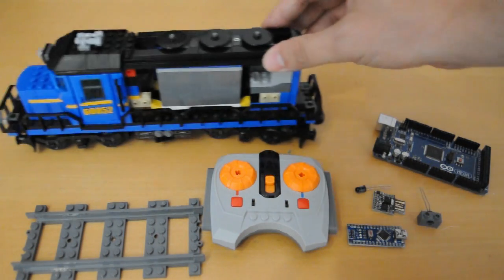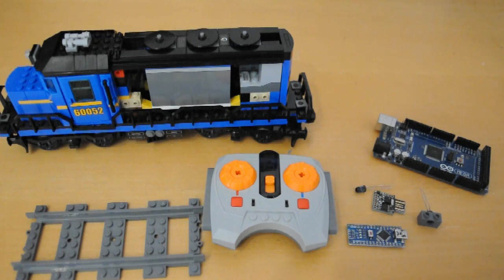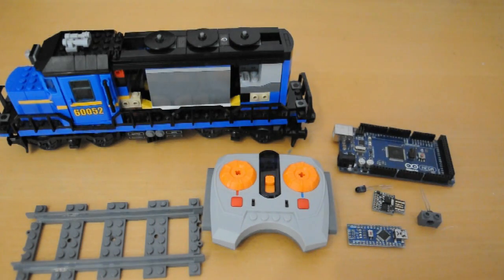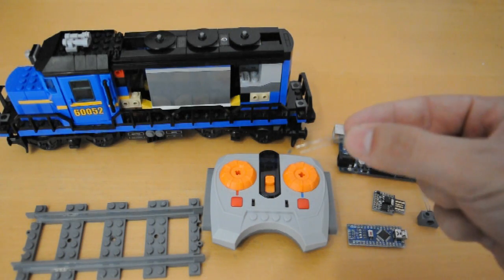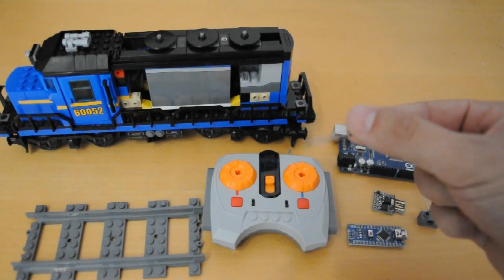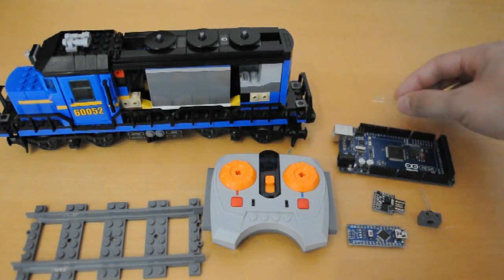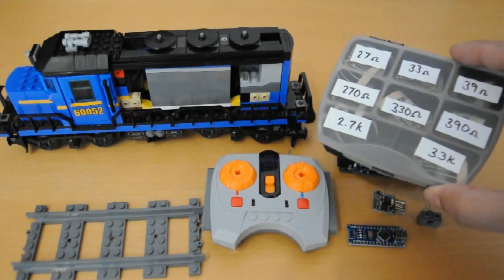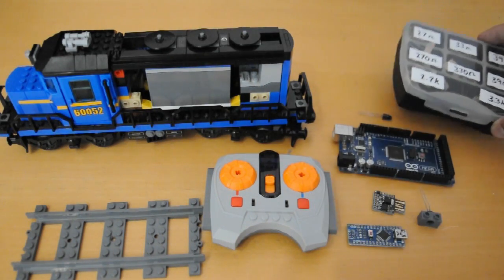So how do we connect the LED to the Arduino? LEDs connect to the ground and one of the digital pins of your Arduino. Each LED has a long leg and a short leg — the short leg goes to ground and the long one goes to the Arduino output pin. We always add a resistor to the short leg when connecting LEDs to the Arduino.